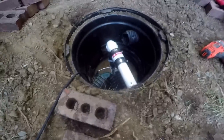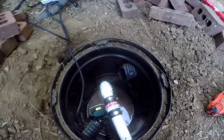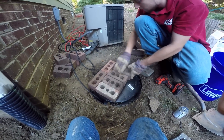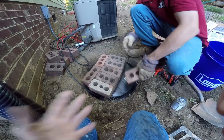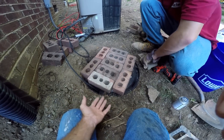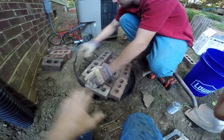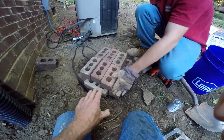This comes with an 11-foot cord, and he's waiting on the electrician who's going to put a GFI up here on the wall. We've got an extension cord ready for him to go. Even though that pump probably weighs about 50 to 60 pounds, we still like to put some weight on top of our pit. Remember we perforated it — if enough water rushes down underneath the pit, it acts like a boat and will try to lift itself up. It can easily float up, but adding weight on top will help, and it will pack itself in within a few days after it rains.